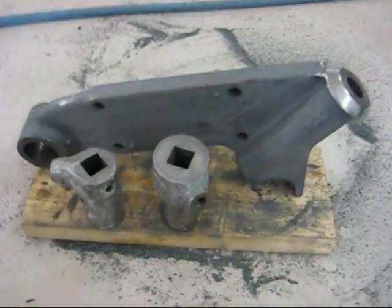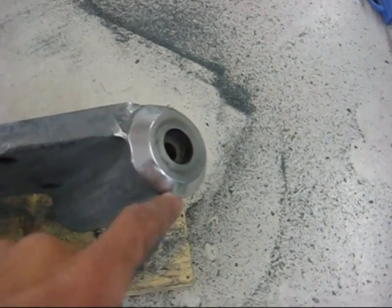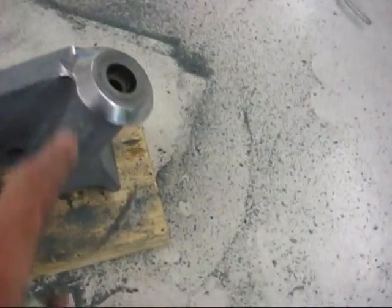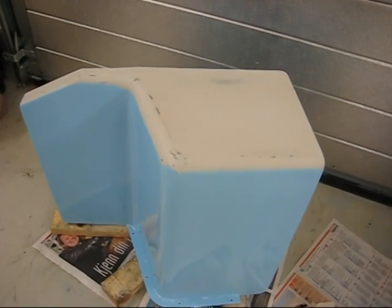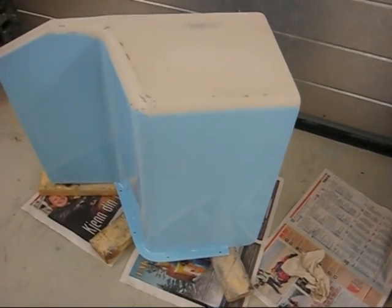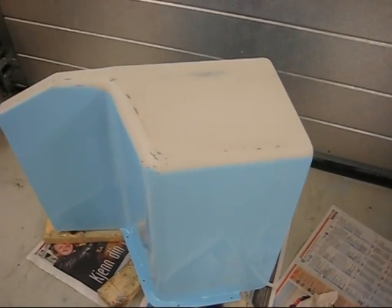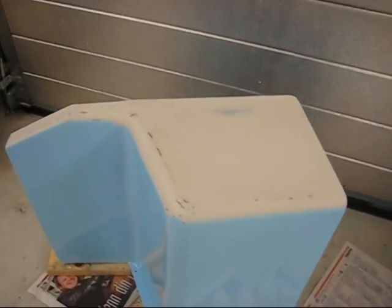These three parts are ready for primer now. I've used a needle scaler and sanded them. You'll notice fun things all the time here — this top part where the thread dial is sitting is actually chromed. I noticed it first down there when I got the paint off. This is chromed too, it just needs a little bit more polishing. Onto the primer. This is the side of the chip shield that was down when I painted it yesterday, so I'll paint that side now. That's the bottom of the tailstock. I'll paint both pieces just with a little brush since I can clean that — the foam rollers are impossible to clean and quite expensive, so I'll just use a brush to paint these too.